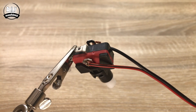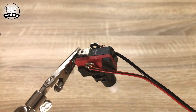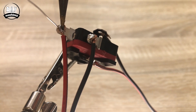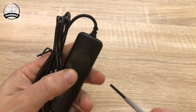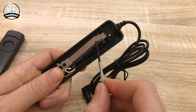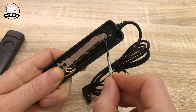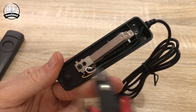I'm using about three to four meters for mine. As I'm using speaker wire, I'm attaching one red and one black wire to each component. Next, open up the camera shutter release housing. Inside you should find three plates — take note of which wire is connected to which plate: yellow to the top plate, white to the middle plate, and red to the bottom. We can then remove the wires and strip them ready for use.